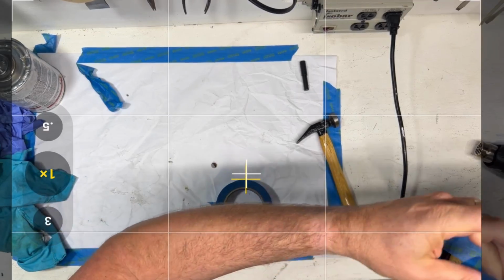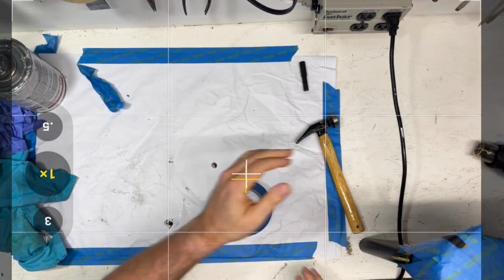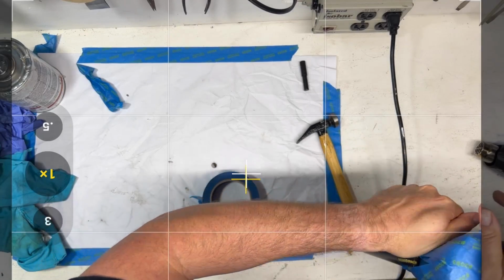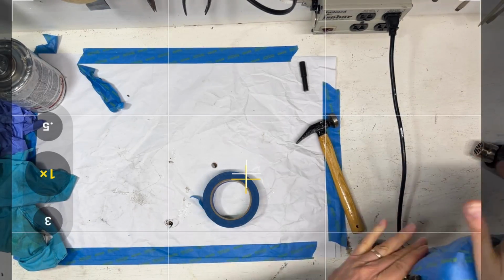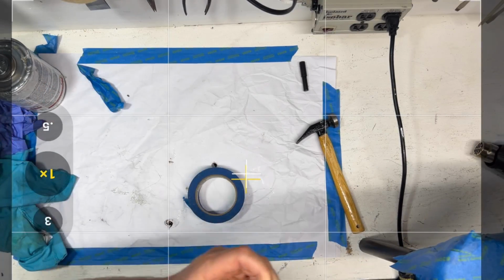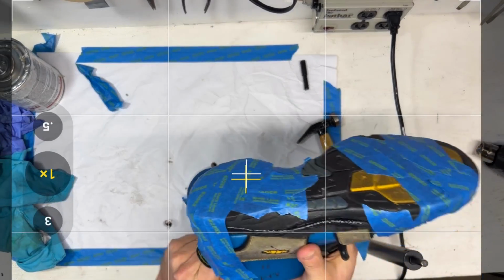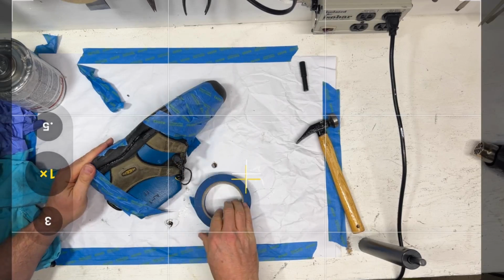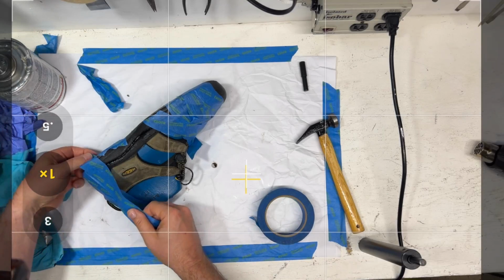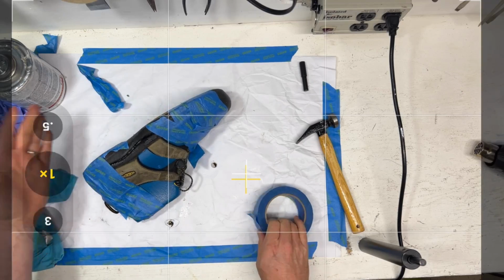Now this glue, it's contact cement, and in the shoe factory they'll put it through a heat oven and a chilling oven, because they're in a hurry. But the glue itself is best bond if you give it time. If you say, oh, I want to get a new shoe and take it right off the assembly line and start wearing it, you don't actually want to do that. You do want to give the shoe that bond some time to fully catalyze and finish.